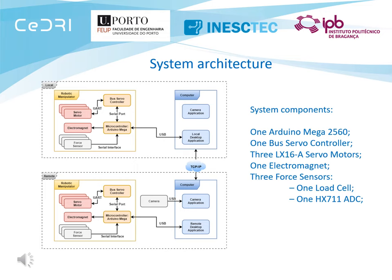The system architecture used for this project is presented in the shown figure. The system is composed of two main subsystems, the local subsystem and the remote subsystem. Both subsystems are very similar to one another in terms of components, with the exception of a camera sensor, which is used in the remote subsystem and not in the local subsystem. This camera is connected via USB and is used to provide visual feedback of the remote environment to the local system, giving a better experience to the user. The Arduino Mega is the brain of the manipulator, in charge of operating the actuators — the electromagnet and the servo motors — and the reading of the sensors and the load cells.